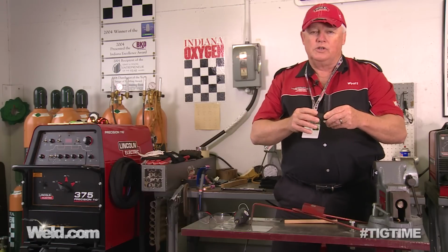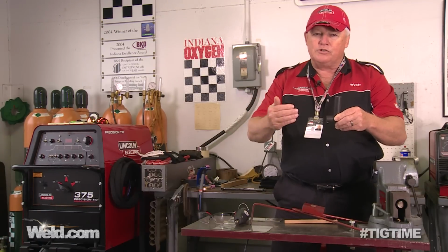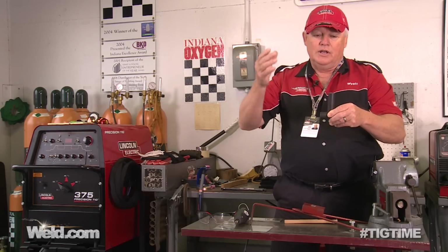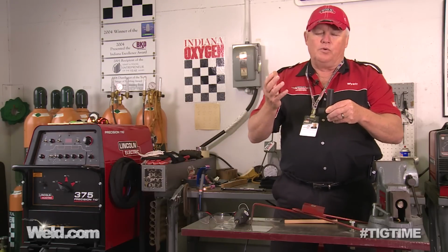It's just low cost. So what you do when the frame is completely welded, we'll pressurize it to about 10 psi. We'll do a bubble test on it, see if we have any cracks, and we'll actually put a pressure gauge on the frame. So stick with us.